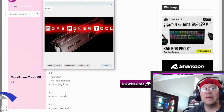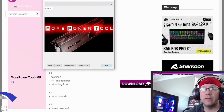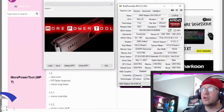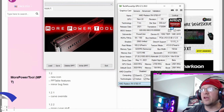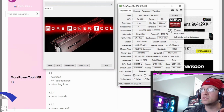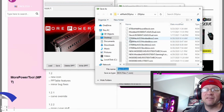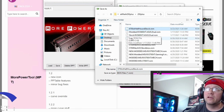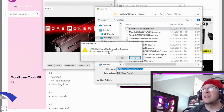Now, before you do anything, you have to have a copy of your original BIOS to modify. You'll do that with GPU-Z, and again, I'll include that in the description. So you hop over into GPU-Z, make sure that you have the 6700 XT card selected in the drop-down. And then there's a little button right below the AMD Radeon graphics right here. Save BIOS. That's what we want to do, save to file. Make sure to name it something memorable. 6700 XT, then the name or brand of the card, and stock.rom is what I usually do. So I use 6700 XT Hellhound stock.rom. So we'll save the original.